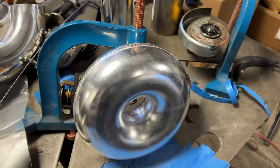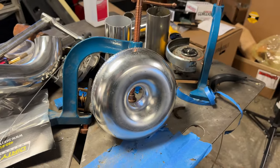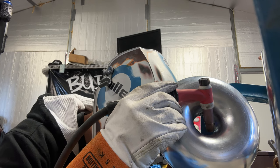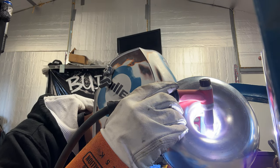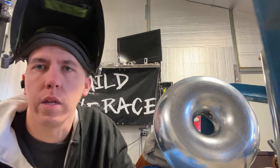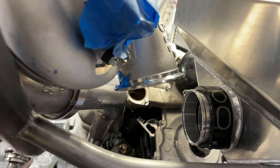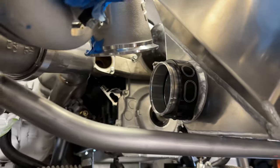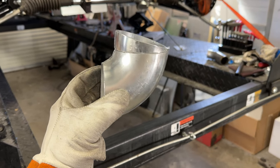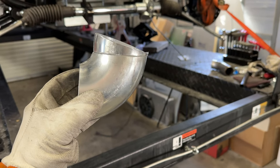The donut I got is welded all the way on the outside, but it's not welded on the inside. So I'm going to go ahead and weld about a quarter of it, and then go ahead and cut it where it's welded so that it doesn't try to spring out and come apart after it's cut. Due to kind of a little angle that way and a little angle that way, once this rotates back, I think something like this is going to work pretty dang well. So I just need that little upper piece to help get it straight, and then we can use the 90 and it rolls in real good.